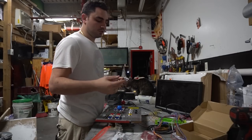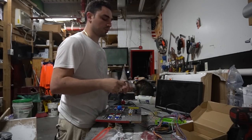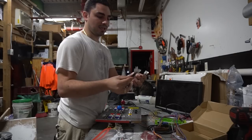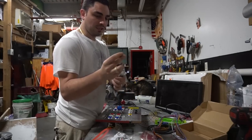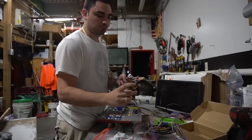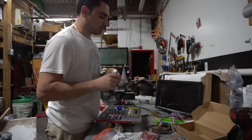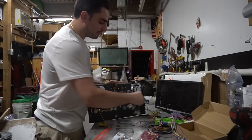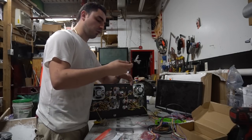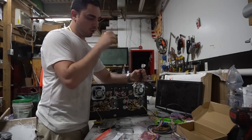This way, if Kodo ever decides to do a Raspberry Pi build or a HyperSpin build, he can basically remove the main inputs but leave the ground input. These Zinmo grounds come right out of Game Room Solutions with the Zinmo controller. I'm going to wire this up and change one end to a male connector, then connect it — player one ground and player two ground.